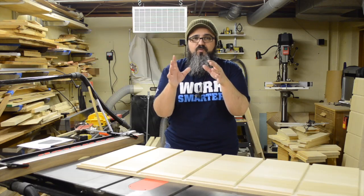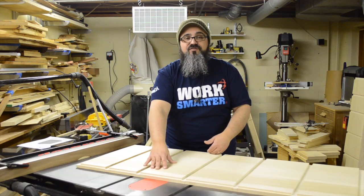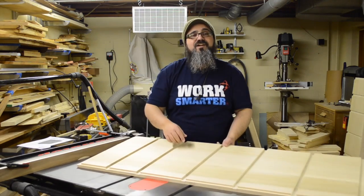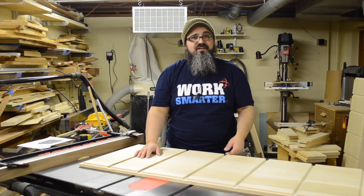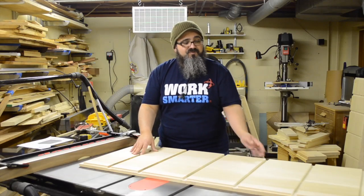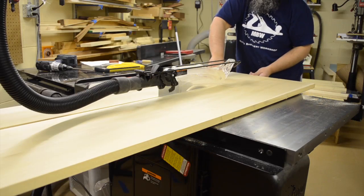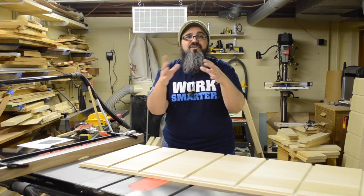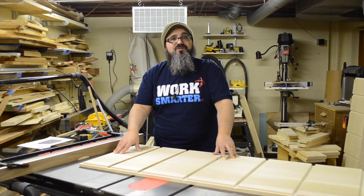I want to mention that I never go to final dimensions until I'm ready. For this first glue-up, the pieces were still in rough dimensions — the panel was supposed to be 19 inches final, but at that point it was 19½. So I had plenty of room to rip it down, re-joint it, and bring it back together. We headed to the table saw and ripped right down the glue line. That left side was proud of the table — right where the cup was. I took a straight edge to the two independent pieces, and sure enough, they were both dead flat, pointing once more to the glue line being the issue.